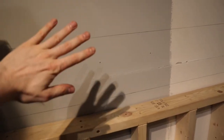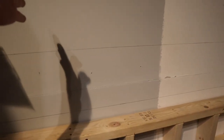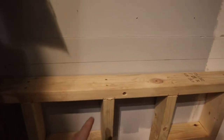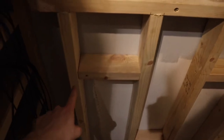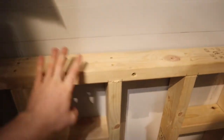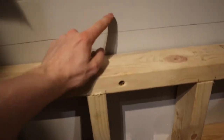There is a brick wall behind this, then I've got wooden studs that go up and down, a bit like this, that are actually screwed into the wall. And then obviously plasterboard over the top of that. Because this was sticking out, because the wall's a bit warped and I think this wood's probably a bit out, I've pushed against it and I've put some mega screws that go all the way through there, and you can just see there one of the dodgy screw holes that I filled.